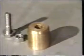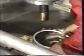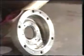Take the assembled cylinder from the FRAMO toolbox and assemble the cylinder on the pump shaft. Remove the lower seal ring housing. Be careful with the Teflon seals. Inspect and change the cargo seal if necessary.